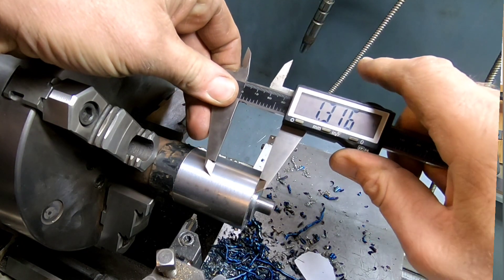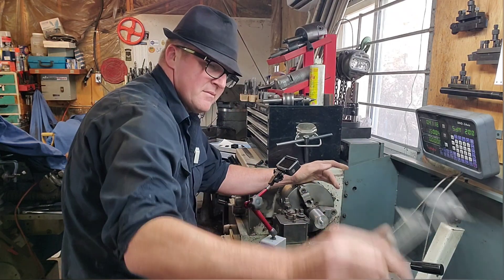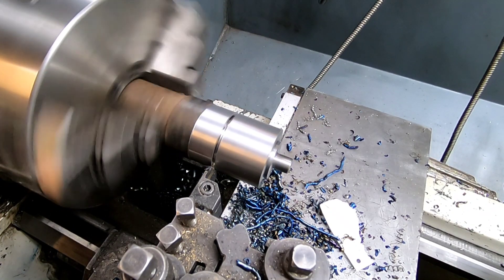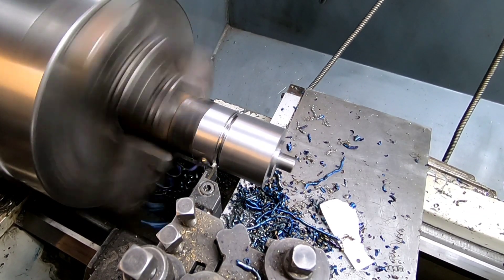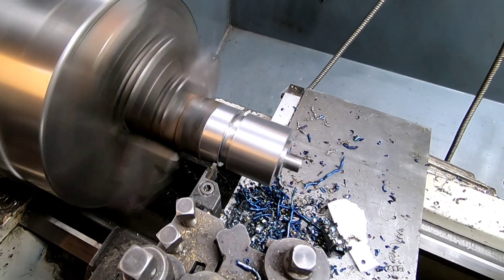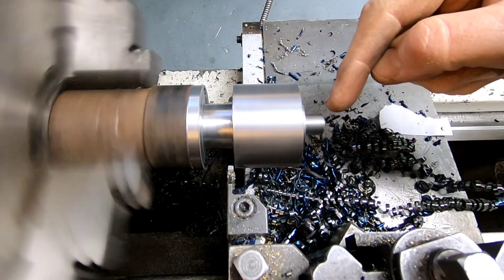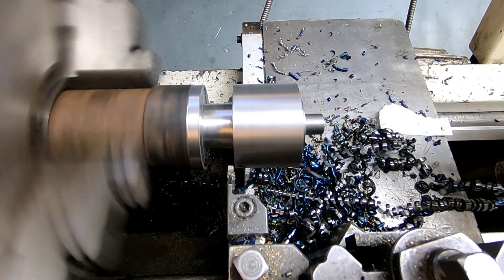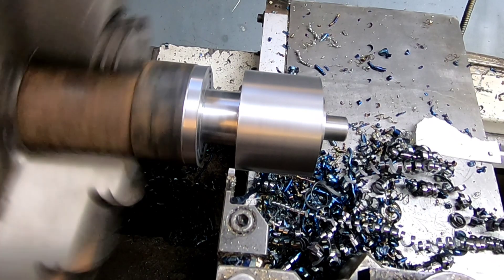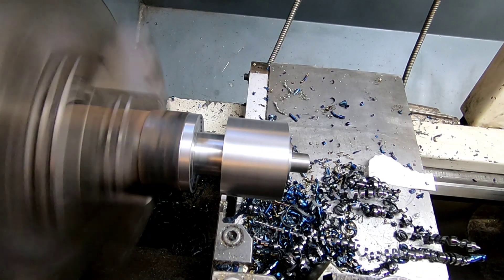Double check — we are correct. Now that I've got it all mapped out on my digital readout I know exactly how far I have to go down to hit that pin and how far to go to get that little wheel that's going to shed the paint. I'm going to cut that half-inch wheel by stepping down, working from the unsteady part to the more stable part. Before cutting all the way down to half-inch size I want to cut this step so I've got that meat on the side and don't get too much chatter. I'll go over to an inch and a half, then minus 110 thou — which is the thickness of the tool bit — giving me 390, and then we're going to go in to 3 quarters of an inch.